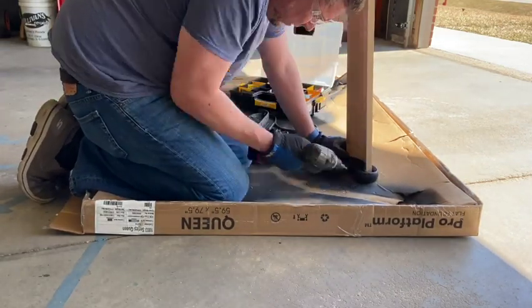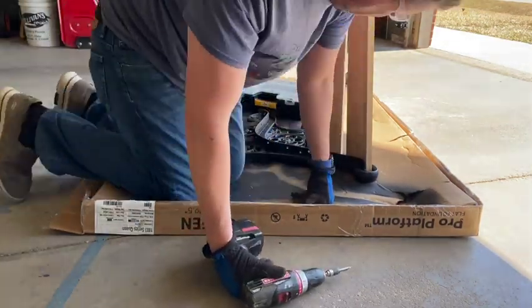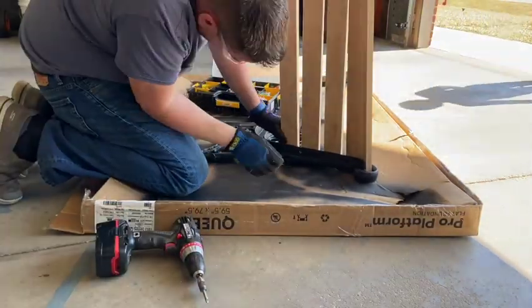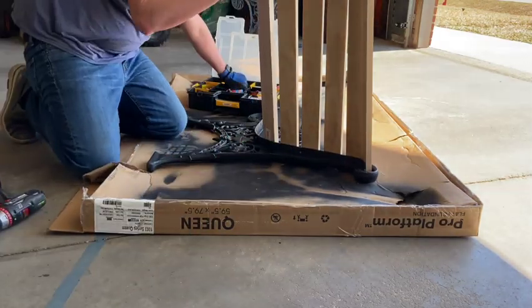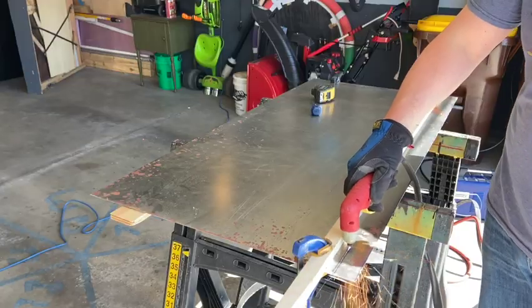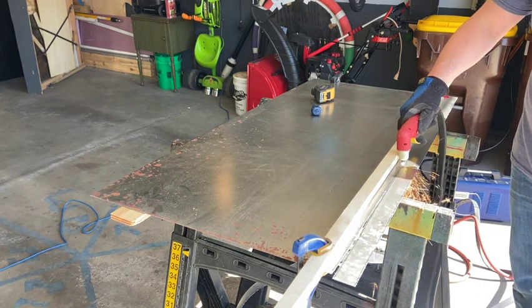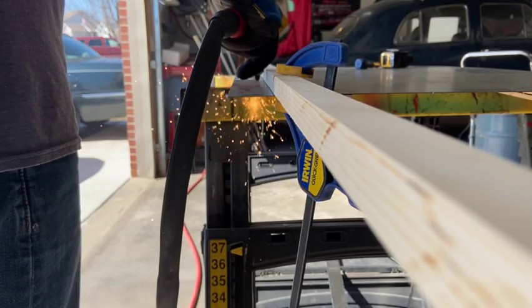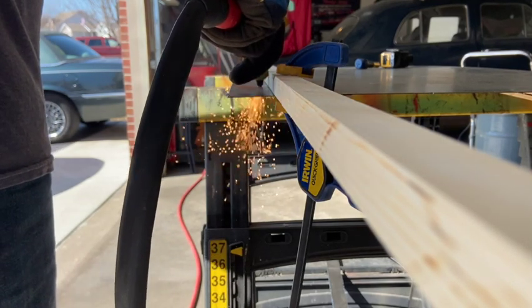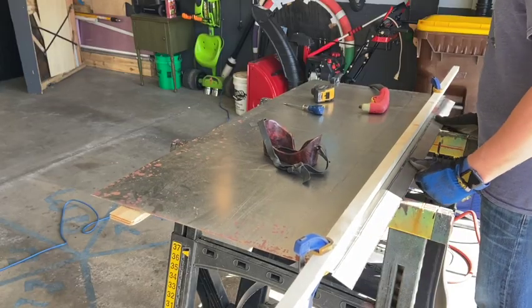The overall bench was 48 inches wide. I'm just using the holes and screwing in with drywall screws, trying to get an idea of what the bench would look like, see what else I needed to do, and make sure the wood I'd picked fit. I used nine one-by-twos and three one-by-ones. There's a centerpiece that makes all the difference for this thing actually being able to be sat on — it ties all those slats of wood together and distributes the load. There are also some other pieces that come up from the bottom of the bench.